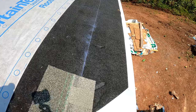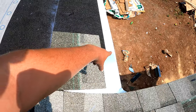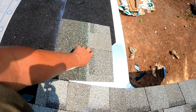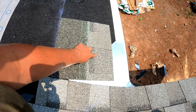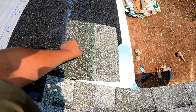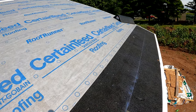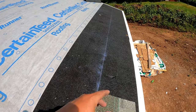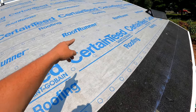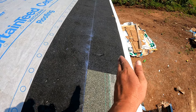The top edge of our second row of shingles will be right there. This first row is going to be just a little bit off — instead of having the entire reveal showing, this first row will have a small amount, like four and a half inches instead of five and three quarters of the reveal actually showing. You can cheat that and take like a half inch out of each one if you're trying to gain a couple of inches, which we will probably do. We'll just cheat these up on top of this line a little bit here and there, so we don't completely cover the amount that we're off in one course of shingles.